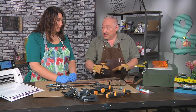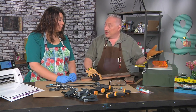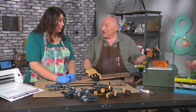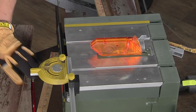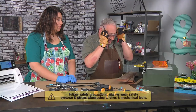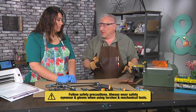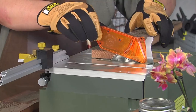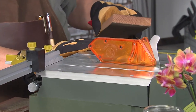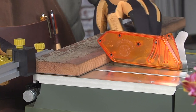We're going to go this way and I'm just going to cut the two sides. What's cool is that this is connected to a vacuum, so it's going to extract all the sawdust — a big part of it — so we don't have to wear masks or anything. I've got to put my safety goggles on. These desktop or bench tools are so small and they're meant for a place where you don't want all that sawdust. I've already got the blade adjusted to just slightly higher than the piece of wood, so we're going to turn it on and begin.